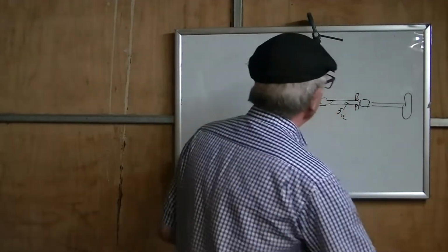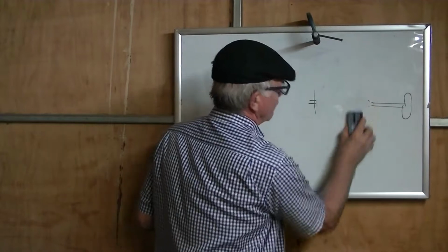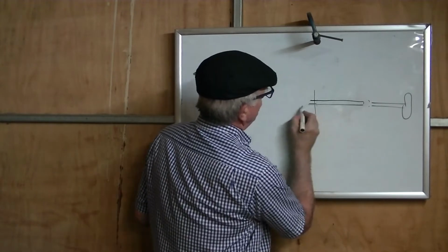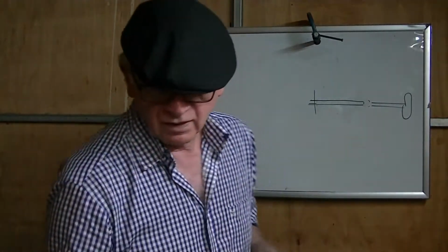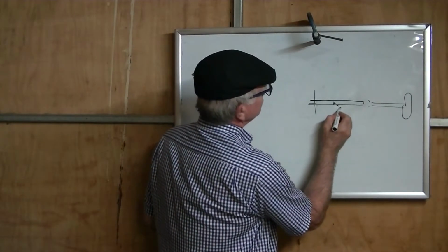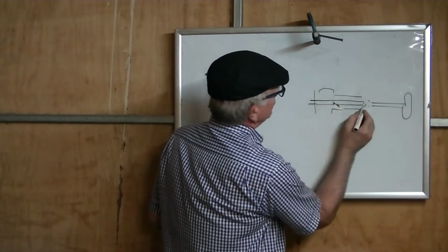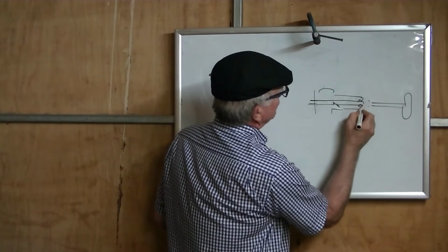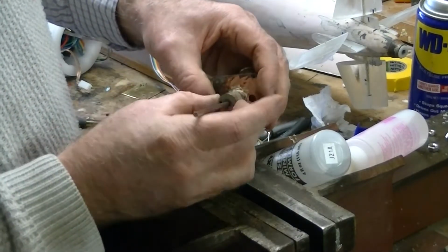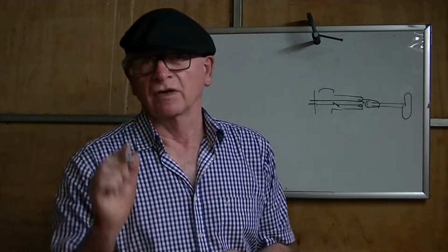What I ended up doing was taking this off, extending this, which is the real strength of a brushless motor. This then was 4mm. I then made a new housing for it with a different O-ring on it, and then connected that onto the motor. Instantly that stopped a whole lot of vibration because it's difficult enough to make one of these, never mind two. Okay, issue number one.